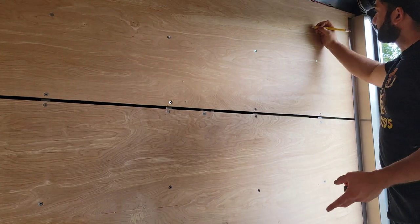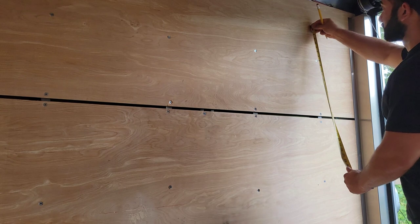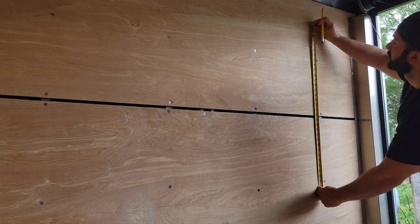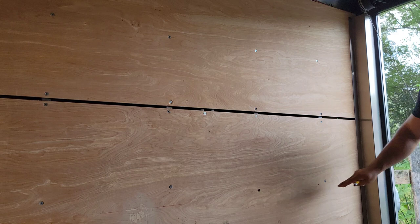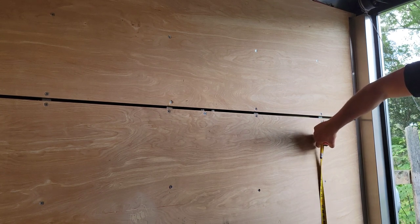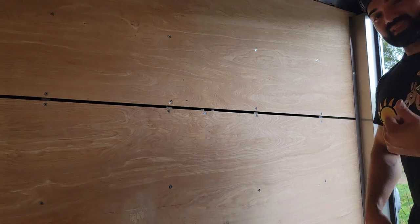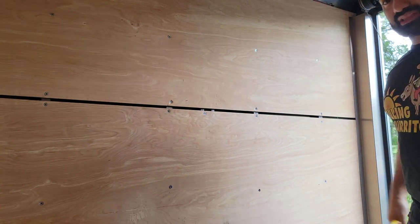Now comes the moment of truth. We have our four holes poked through the wall. I have to make sure my drill bit was level. From right here to down here it measures 31 and three-quarters, so let's measure that. Going to the top — pretty darn close, just have to make sure we go to the bottom of one hole and the top of the other. That's going to be our window cutout. From here to the floor to the bottom of the window is roughly 33 to 34 inches — that's where the serving tables are going to go.